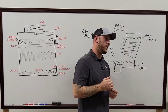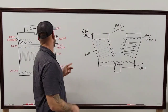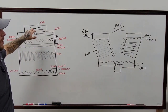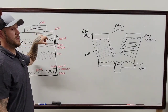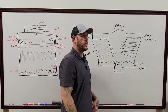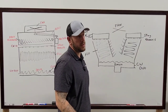And then another thing too on those gearboxes that run up from the motor to the fan. On the front of those things, it's got what they call a pinion seal. If you see that there's an oil leak coming from that, always make sure to write that up, because it's never gonna fix itself. It won't suck the oil back. You have to get it replaced, eventually.